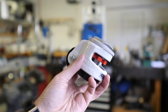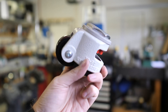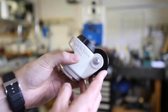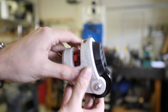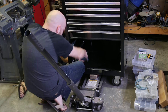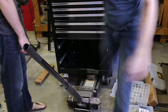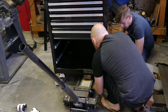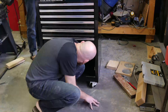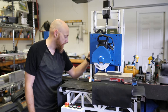The solution is machine casters — got them on Amazon for about a hundred bucks, supporting around 2400–2600 pounds. They're clever: you only use the casters when you want to move the machine, otherwise you spin a lever and feet come down pressing against the floor for a solid, stable base. That's a whole lot better — not perfect, still wobbles a little bit.